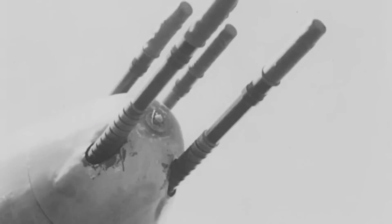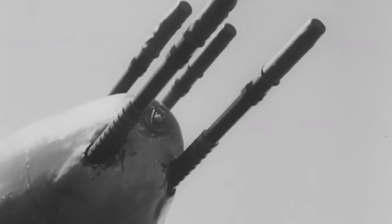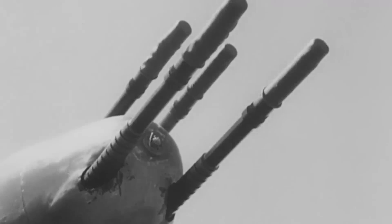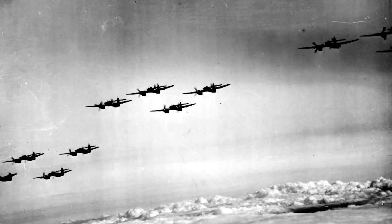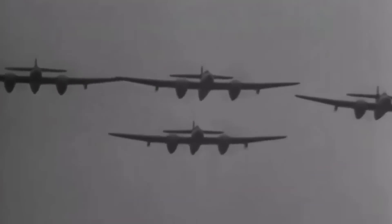The de Havilland blades were thicker than the Rotol ones, and were unusually thick for a fighter propeller of this period — the profile was designed by the American Hamilton. When a propeller blade rotates, the air is pushed out of the way; the thicker the blade, the faster the air has to move. The speed of the rotation also comes into play: the longer the blade, the faster the tip will be moving. If either the thickness or the tip speed reaches a critical point, the air cannot move fast enough and the propeller is effectively breaking the sound barrier. The shockwave produced causes a sudden increase in drag. The Whirlwind was let down very poorly by having to use the de Havilland propellers, which were very much thicker than the Rotol propellers.